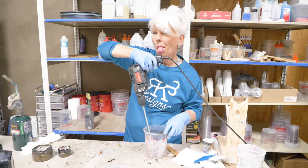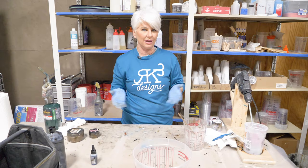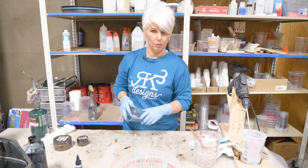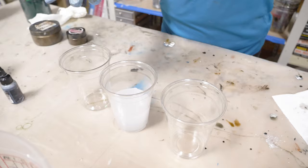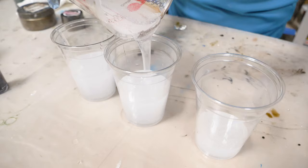We have our art coat epoxy and I've mixed it at three ounces per square foot. Our table is a 36-inch diameter round table, which Siri tells me is seven square feet. Now what I'm going to do is separate my clear epoxy into an opaque white, a translucent white, and a clear. I'm going to use very little of the opaque white — I just want it to build some depth because I still want to be able to see the design underneath. Most of it will be translucent and clear — I want more clear so that design really shows through.